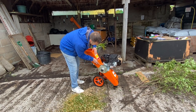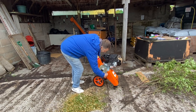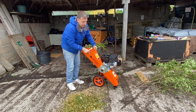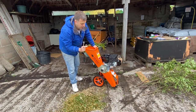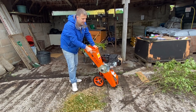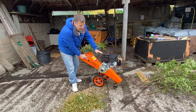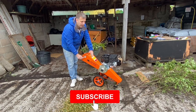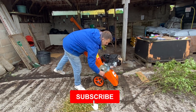The first thing we need to do is loosen these. And as you can see, you can move it. You're supposed to have it set to around there, about 3 centimetres from the ground. If you are within the US, or in a country that doesn't use the CE regulations, then you can actually have it as high as that. To be honest, that's obviously a better working height, but there are safety reasons for the lower setting. So I'll put it back down there and tighten it.